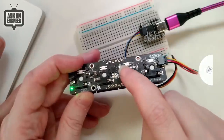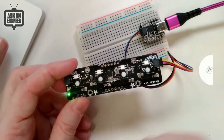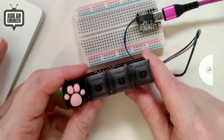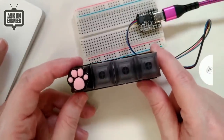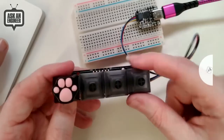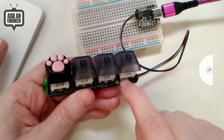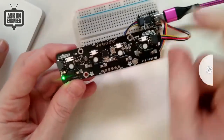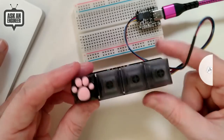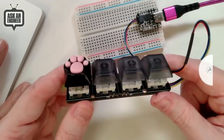There are address jumpers you can close to connect multiple boards to one I²C port — up to 16 of these on one I²C bus. So if you're making a macro pad and want to quickly get a bunch of keys together without much soldering, you just plug in your favorite mechanical key. There are four mounting holes on the corners and you can also plug into a breadboard for easy perf-boarding. It's a fun way to get mechanical keys into your project without any key matrix handling or NeoPixel handling — it's all done for you.